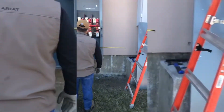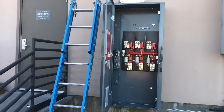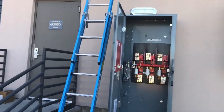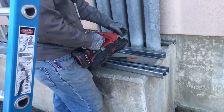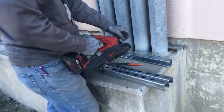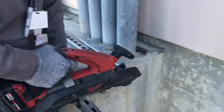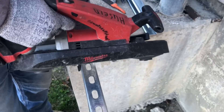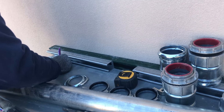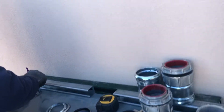Today's the day we're gonna take measurements to bend some pipe to get down into the disconnect. I don't need too many bends, maybe a few 90s. We're gonna cut some unistrut to have it stuck on the wall because we have to have all our pipes secured. My boy is cutting it and taking measurements for the pipe as well, because we got to go inside to the table bender.